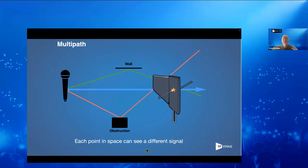But it's not going to receive information that's harmful to the other side, because they're both seeing the same thing, right? There's no phase difference between the two signals, and that means you eliminate that polarization crossfade. That cannot happen with these antennas. So that's the advantage of our diversity fin, our omnidiversity, when that's the right thing, by co-locating these in a single point in space.